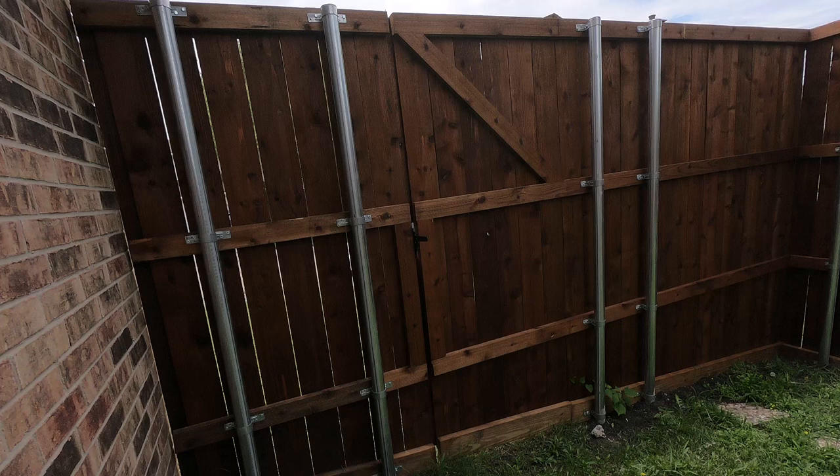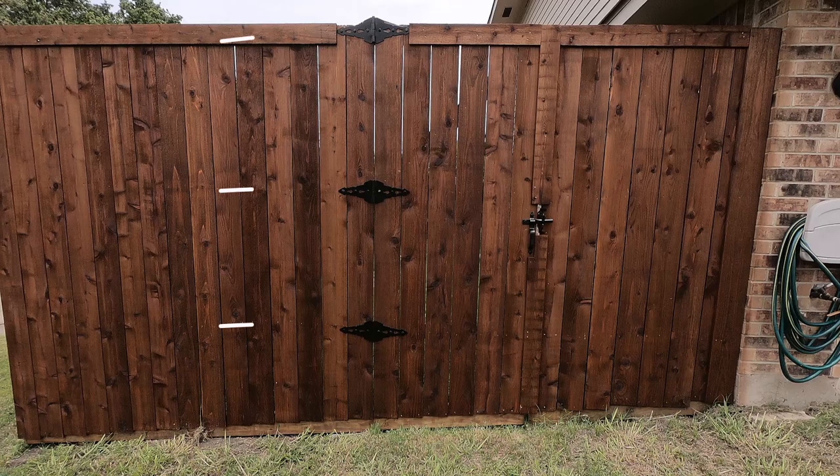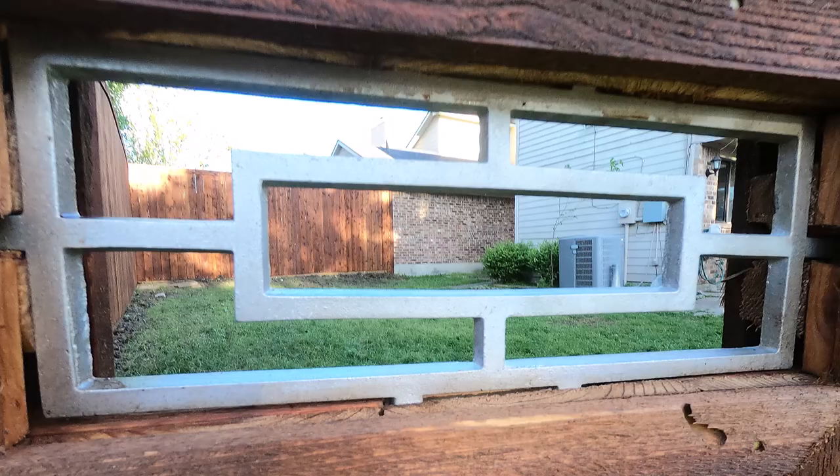Here's a great shot of the back of that gate. Now everybody hates a gate that drags on the ground that you have to pick up — it's just ridiculous. And this is how you can stop that. First, let's identify the hinge side and the latch side. You'll notice that we use double posts only a couple of feet apart to increase the rigidity and lessen the chance of that fence being able to sag. Plus, we add 3 heavy duty hinges bolted to those 2x4 western red cedar nailer rails.